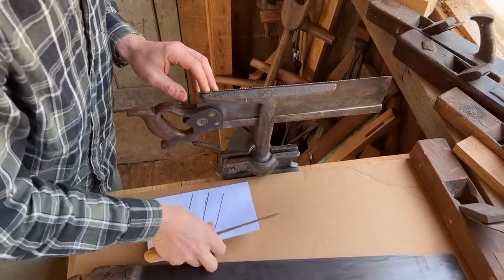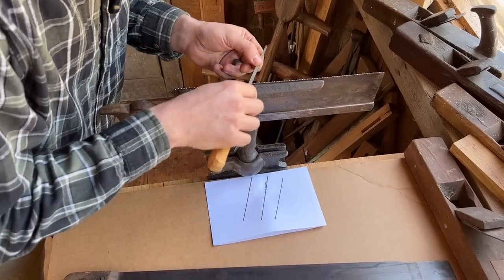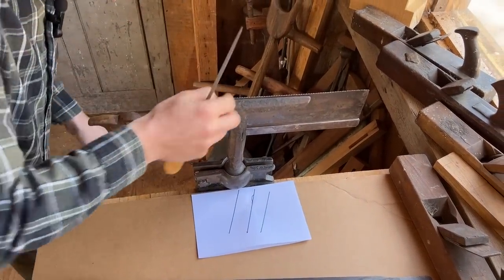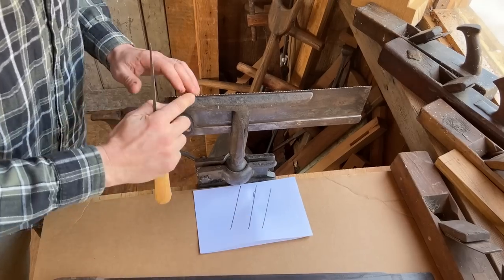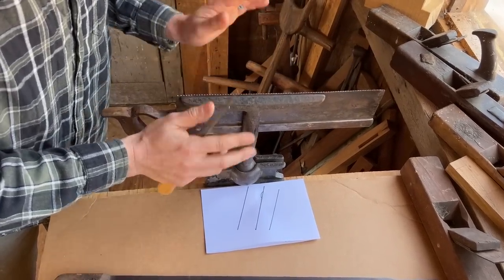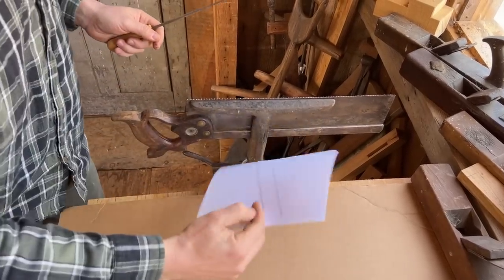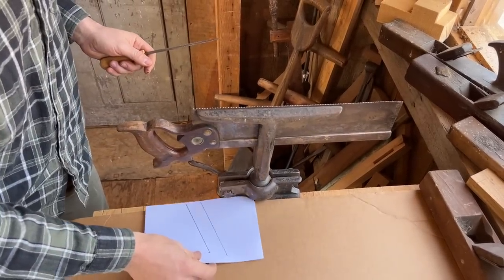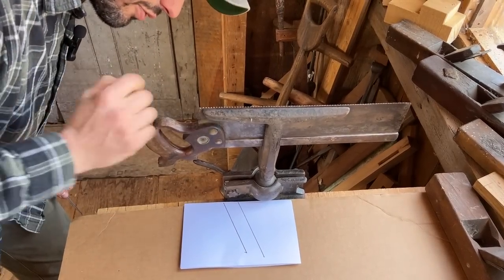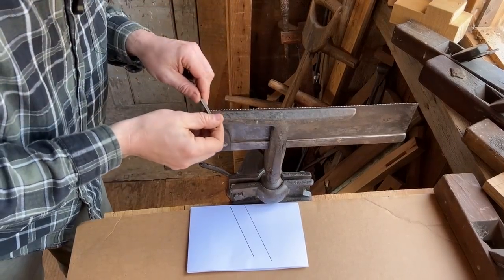So you can continue on, if you want, slide the paper up, keep eyeballing your teeth, pause and look down, make sure you're doing what you want to be doing until, again, you've marched all the way to the end. Now, I keep the saw right where it is. You can flip your paper and start back here. Find the tooth that you sharpened before, the starting one, go to the next one. So now we're sharpening in this direction.